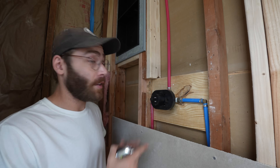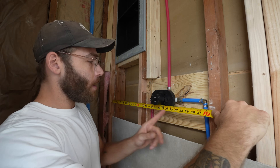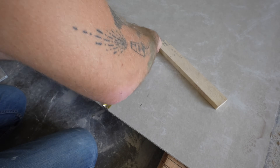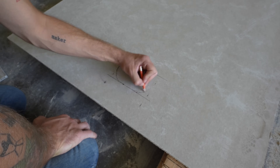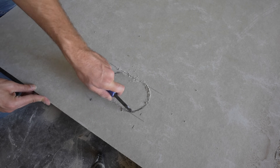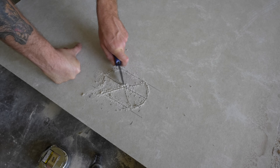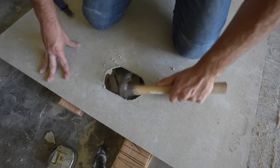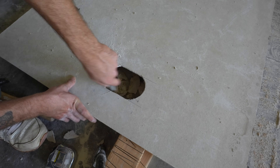Measuring and cutting for obstacles like this mixing valve is easy. I'm just going to measure off of this wall to measure how far it is on each side — that's twenty and a half to twenty-six and a quarter, and here it's four and three-eighths to eight inches. I'll transfer those marks to my cement board, making sure to subtract an eighth inch for our gap. I'll show you how you can cut this with a scoring knife, although a good alternate is a jigsaw. I'll score it into segments like a pizza and then knock it out. Remember, the more you score and the deeper you score, the cleaner the break will be, but the utility knife comes in clutch to finesse it.